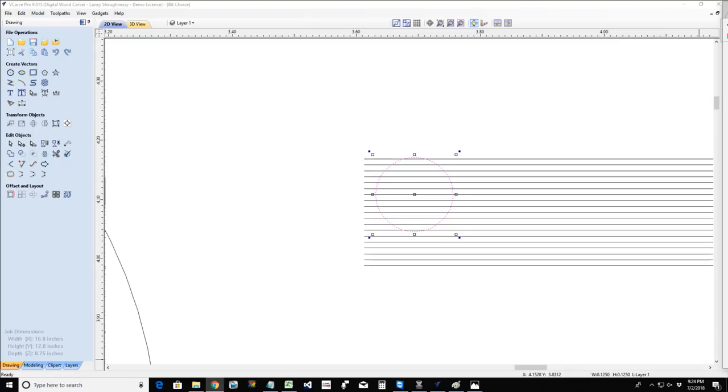Now, Joe came back with an eighth inch bit at 144 inch feed rate. What is the depth of cut? 16th of an inch or less. 50% the diameter of the bit or less. So for that, I would probably be at a 0.04 or 0.05 depth of cut. Maybe up to the half, you know, 16th of an inch at 144 inches a minute.